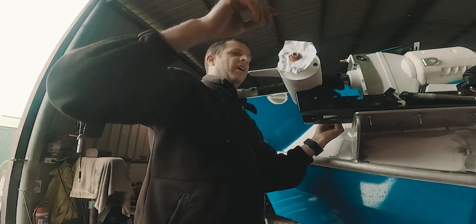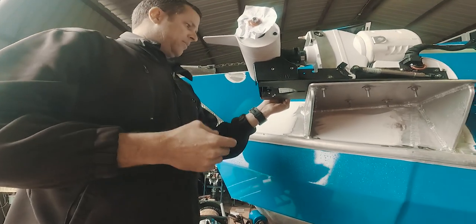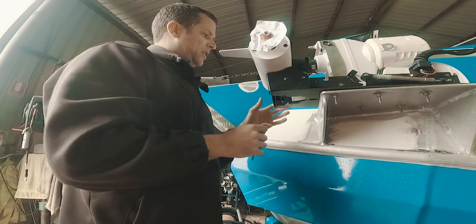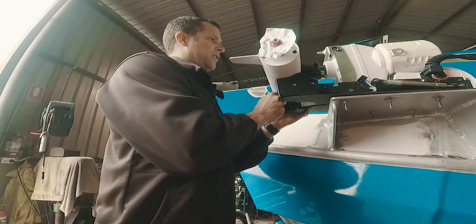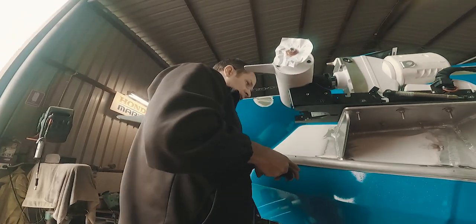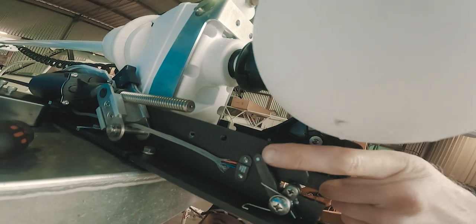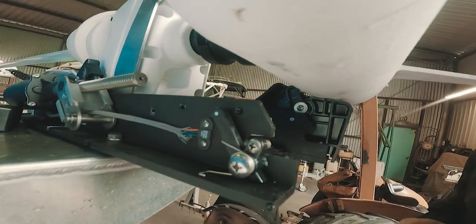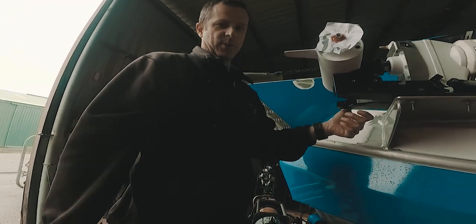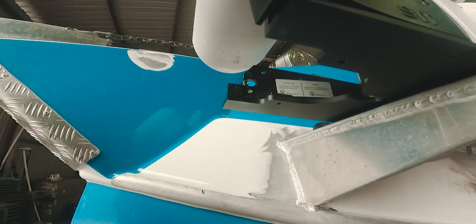It's going to put a bit of grease on the arm on a switch in here. Basically this is the one that tells the computer whether it's deployed or not. What can happen is it gets a little bit of salt in there on the bush that's holding this arm on the switch and it doesn't disengage — so it thinks the motor's always deployed. You'll stow it and then you won't be able to deploy it because it thinks it's already down. This little arm here — just need to make sure that's nice and free and moving. If it's stuck all the way across, you can get your hand in there and flick that little lever back and see if that fixes it.